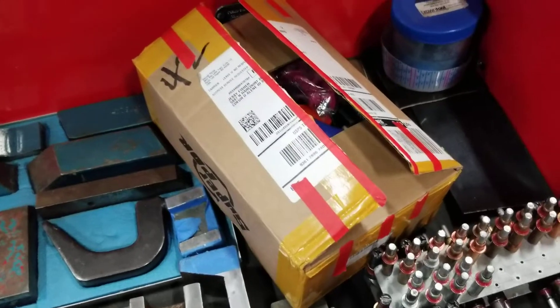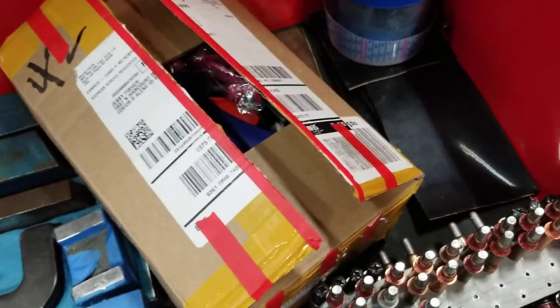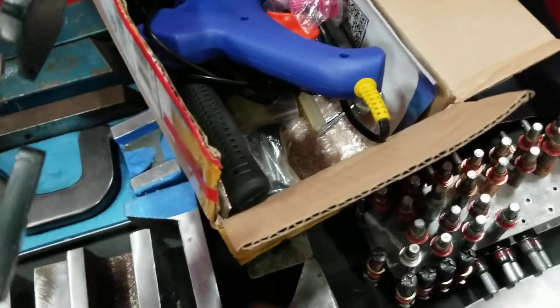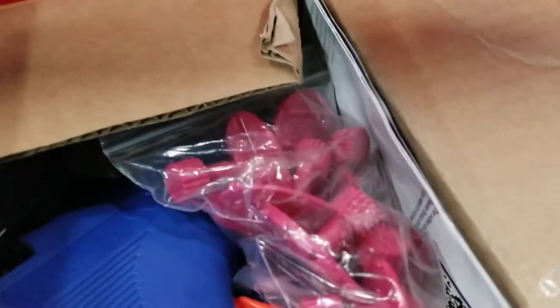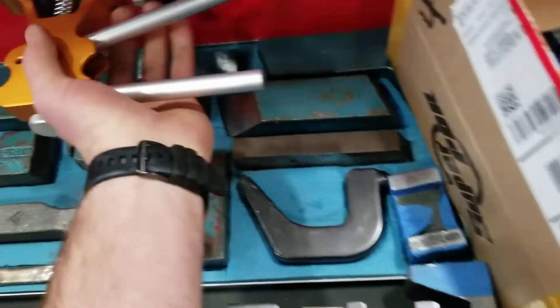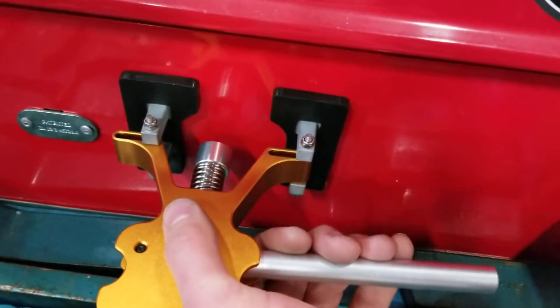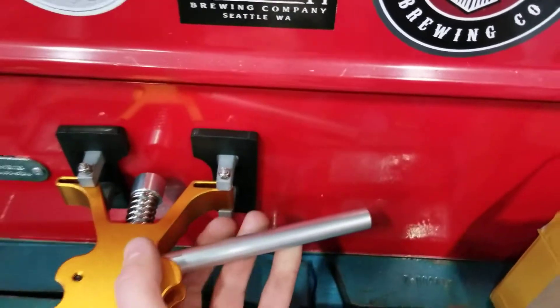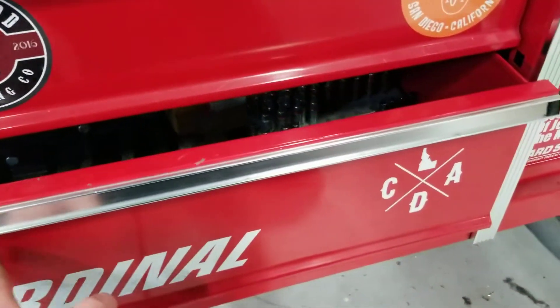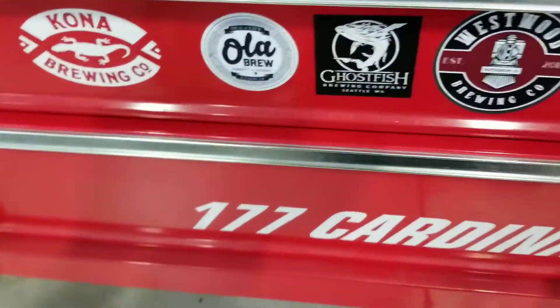I keep Clicos down here and that extra jaw for the squeeze up top. In this box here is what I was referring to for cold working dents. I went on Amazon and purchased a kit that is used for pulling dents. You hot glue these little pads into the center of the dent, then attach the pad to this end and you can put this up against the aircraft skin and pull slowly — you don't want it to snap. It actually helps cold work the dents out. In the commercial industry, almost every airplane that comes through has a dent we have to evaluate — whether each one is in or out of limits — so that is super helpful.